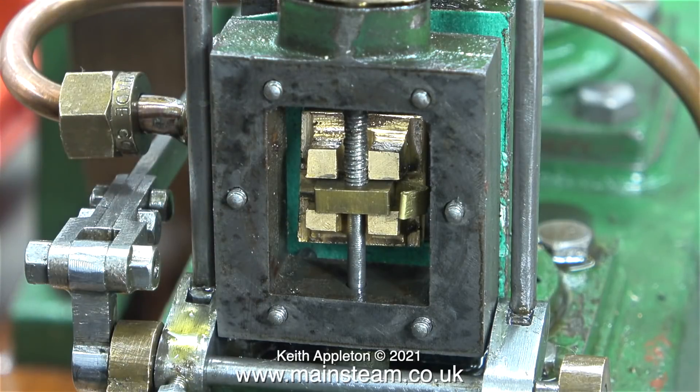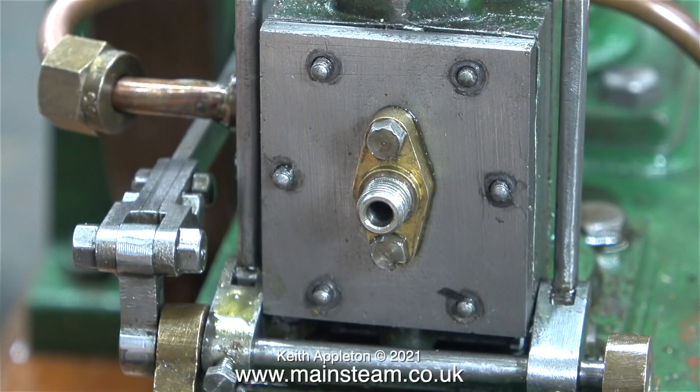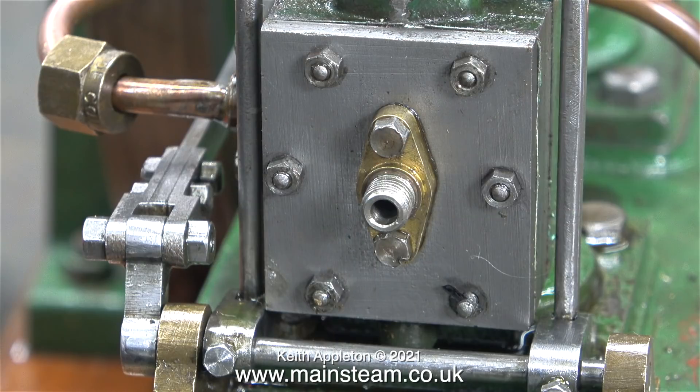I'm using a folded piece of brass — this was quite a fiddly job. I folded a piece of brass and hammered it flat, then bent it at 90 degrees at each end. Here you can see it in place behind the driving block. This brass shim is not a tight fit and it can move around, but it cannot escape because it's bent at 90 degrees at both ends. It's simple, not the first time I've done this, and it's always proved quite successful — a lot quicker than machining a new slide valve.